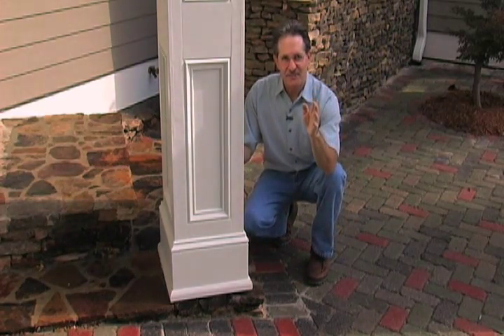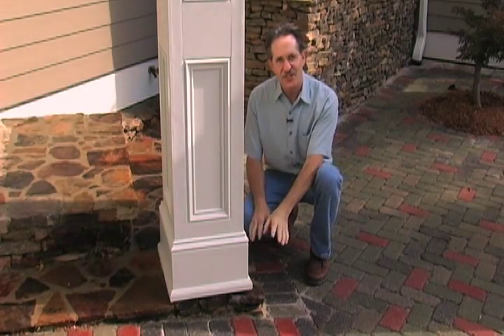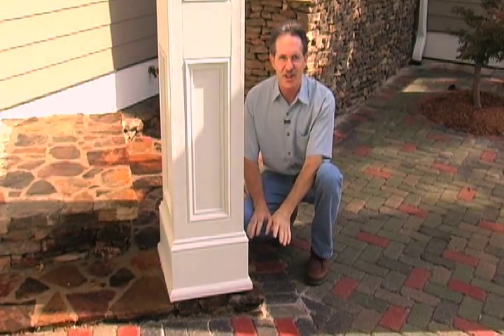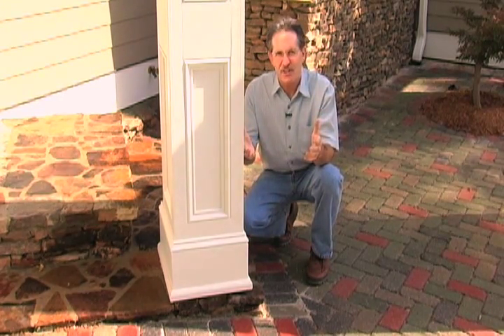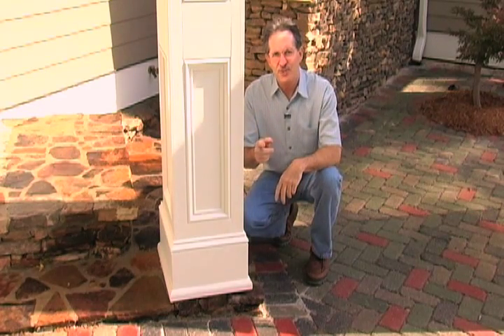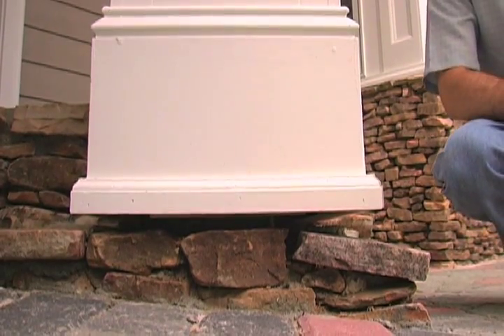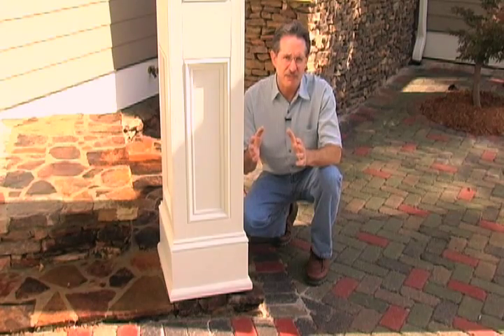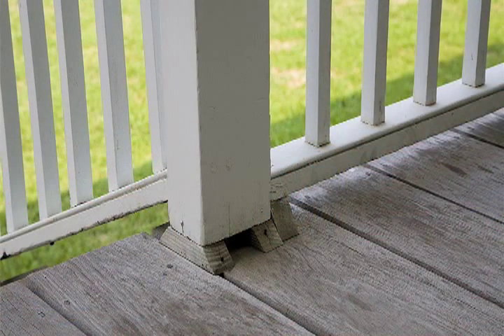When you're installing columns, don't place them near the dirt directly on decks or on the concrete. Build a stone or masonry plinth for your columns. Elevate them so there's plenty of clearance for running or splashing water. Be sure to include drainage between the bottom of the column and a deck or patio, not only so moisture won't be trapped behind the trim, but to provide plenty of room for air circulation too. In Louisiana, I've seen columns elevated three-quarters of an inch above the decking material — that's a rule to remember for high humidity areas.